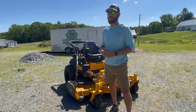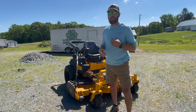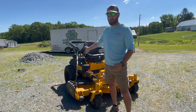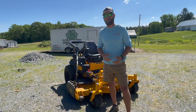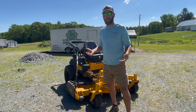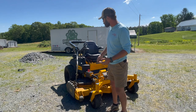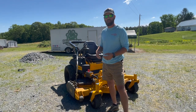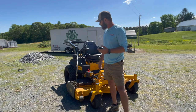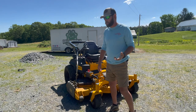I can't say for sure, and I certainly don't want to tell you to just blow it out and be fine. Usually, in the past, I've always blown out my air filters. But with a machine like this, as expensive as they are and as cheap as air filters are, I mean, they're $20 or $25 on Amazon. Matter of fact, I'll drop a link in the description below for the ones that I use. Kawasaki filters, they fit on this. They fit on my other Kawasaki motors. But as cheap as they are, I might as well just go ahead and replace it.